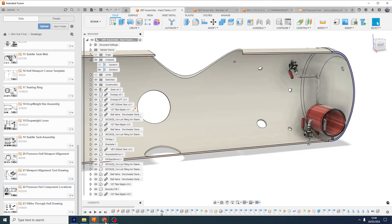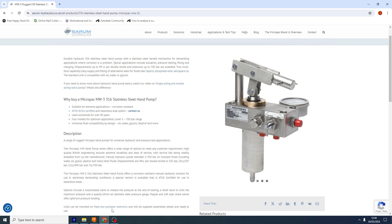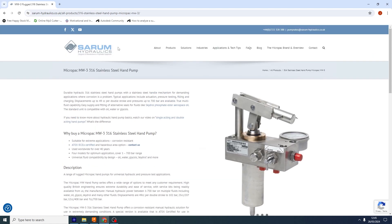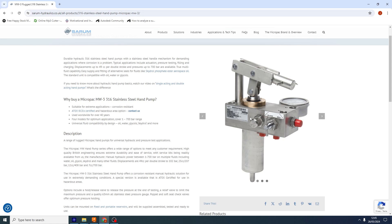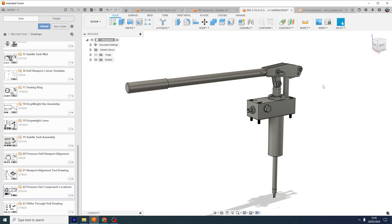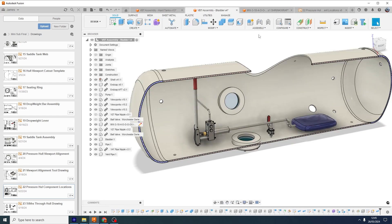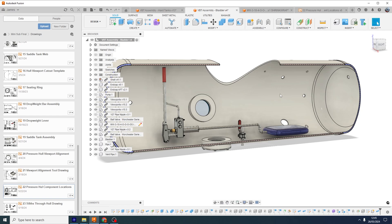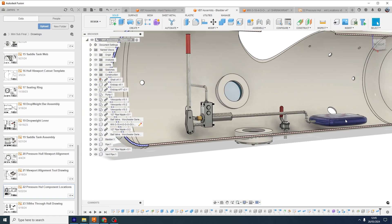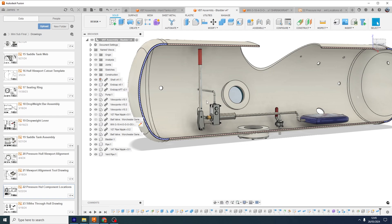The next idea is using a bladder with a high-pressure pump to get the water out — this one here by Sarum Hydraulics. Not sponsored, I'm afraid. The pump is very expensive, which is one of the downfalls. They sent me their CAD drawing so I didn't have to model it up, and I've put that into my own drawing. There'll be an inlet valve that lets water into this flexible bladder. It's all low pressure — you're basically just letting water into the hull. Then you close the valve, and the high-pressure pump sucks the water out of the bladder and pumps it out of this outlet pipe.